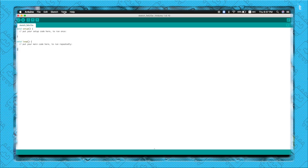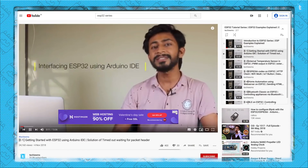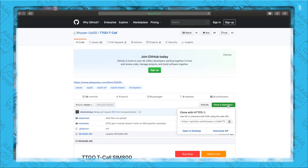Now let's jump into the Arduino IDE and see how to use it. Before looking at any code, I expect everyone has ESP32 board packages already installed. If not, follow the linked video which will guide you. This module doesn't have any particular library; instead, we can use the TinyGSM library for all the SIM800 module functions. I'll suggest you also download the example code linked in the description, which will make getting started a bit easier.